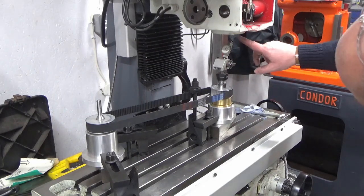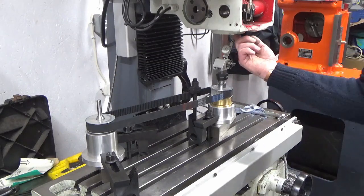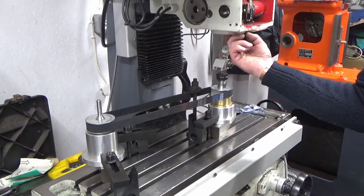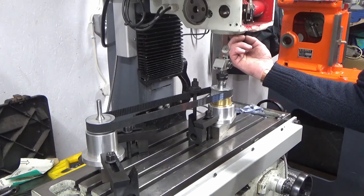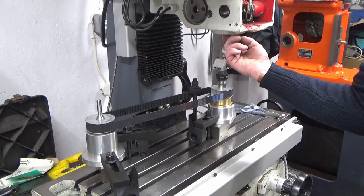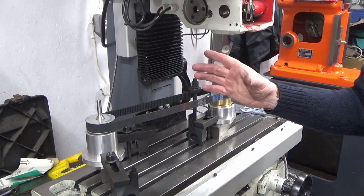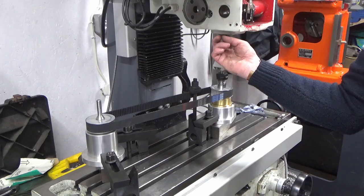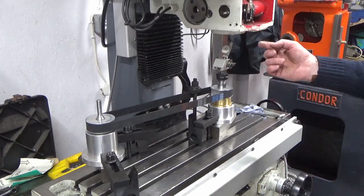And what I'm doing is, so I've done 2 things. I've checked the bore at this end, and we are 1/10 of a millimetre bigger on diameter than the bore that I've put through my stiffening ring. So yeah, there's a lot of slop in this front end of the spindle.